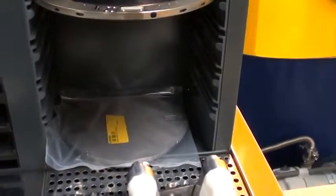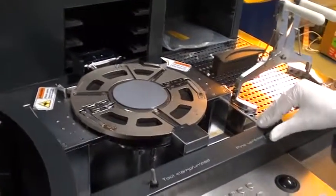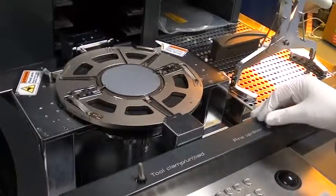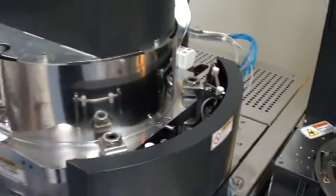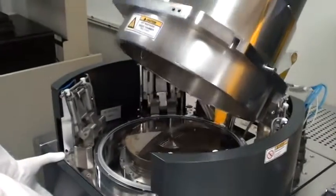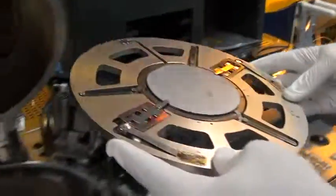We're going to be doing this demonstration using 4 inch wafers and I'm about to set that up right now. So we have the 4 inch wafer here already in place. I'm just going to lock this in. I'm going to open the chamber so I can load this. I can see that the chuck is cooled so I can remove this by hand and put this straight into the chamber.